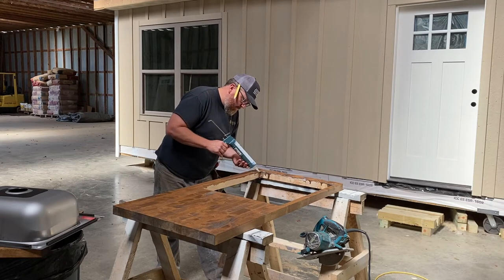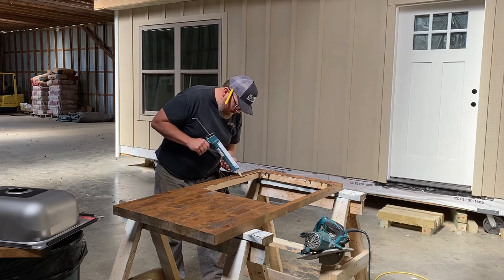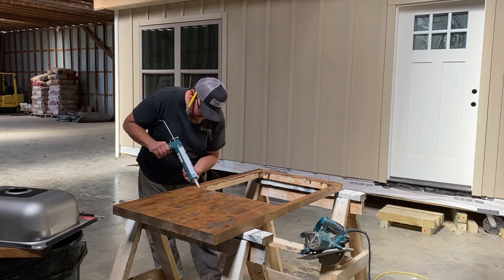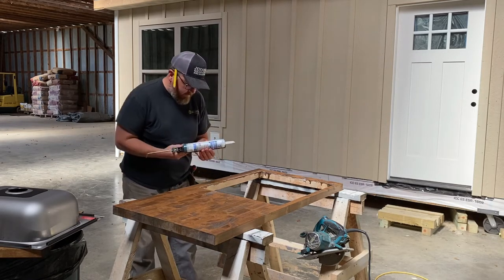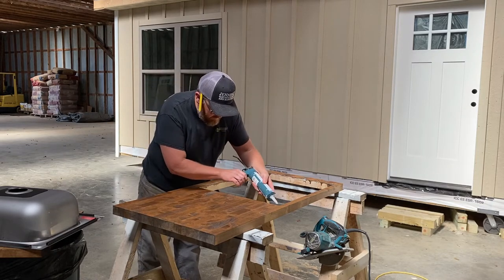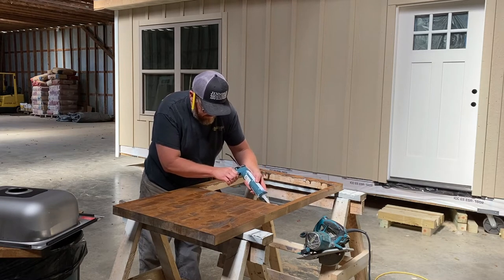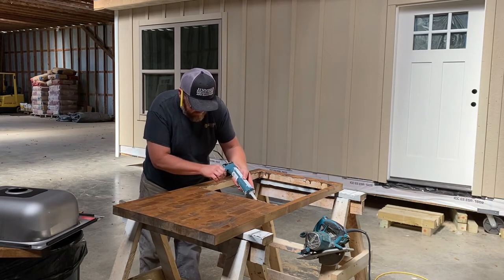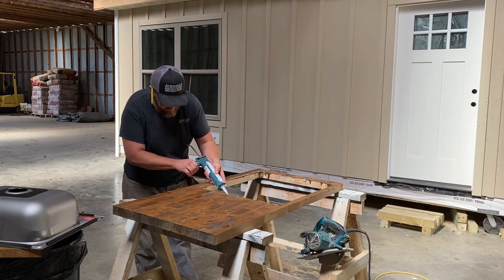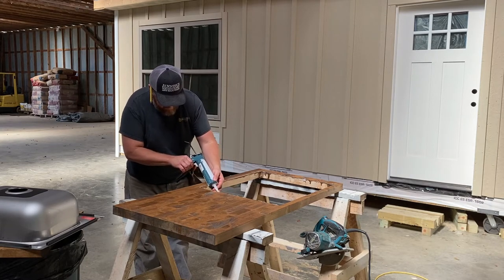Simply lost the footage here of me staining these. My apologies, I'll get better about that, but nothing really to it. I just simply used the material that I mentioned from Lowe's, wiped it on with a cloth. I actually did two coats with about 15 minutes in between. One other option you can have if you want a super slick feel that'll close up the pores is to pre-sand this with maybe a 400 grit or so sandpaper on an orbital sander. So I did that, and was able to get this stained with two coats while I went to lunch,